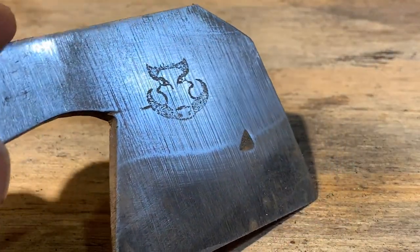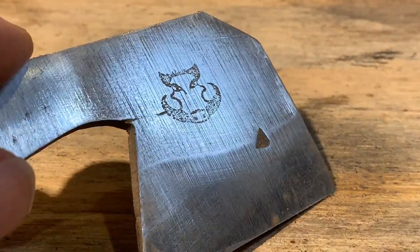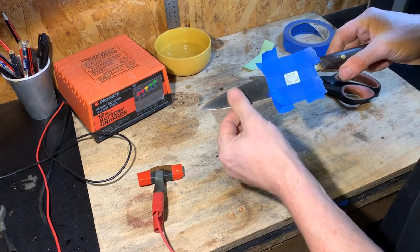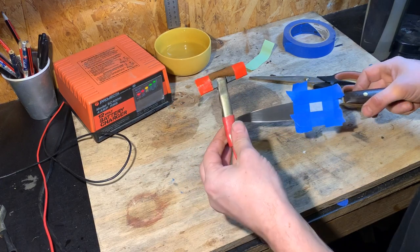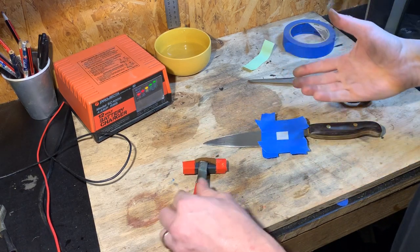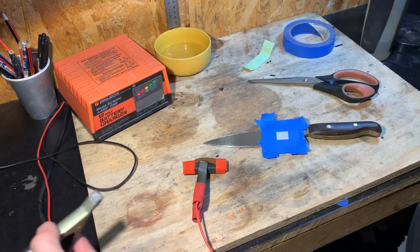You can see what it's done. On a flat blade and with a longer etching cycle, I reckon that's going to look pretty sweet. This time I'm just using this random knife — the first knife I ever made — which has a nicer, smoother finish. I'm also going to switch up: I'm going to use the positive on this side and the negative on the knife, no idea if it makes a difference. Last time it did, but this time I didn't get a lot of black in the etch. So maybe I just got it wrong — let's see what happens.